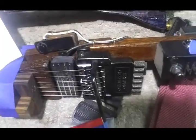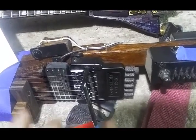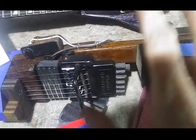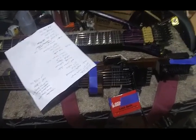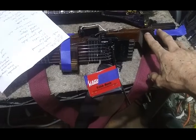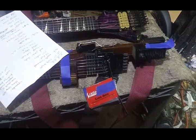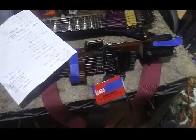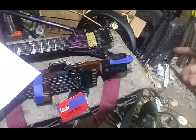So I think we're going to do a video on frequency response curves and EQs and pickups and speakers and amps, because each of these devices has its own frequency response curve, and these things stack up and superimpose on each other. You take what the pickup's putting out, send it through an EQ, and then through an amp, and the amp has its own frequency response curve and its own Q values for how flat that curve is. All of these various curves add up to the final sound you get out of your speaker. And even the speaker itself has its own frequency response curves.